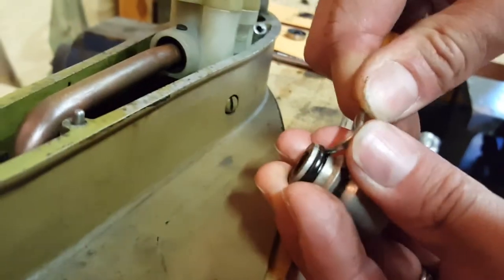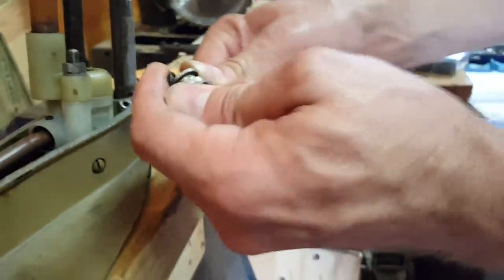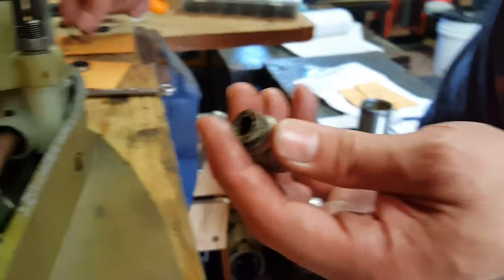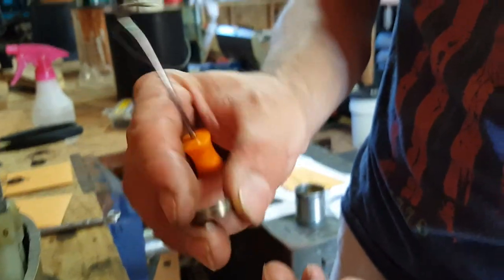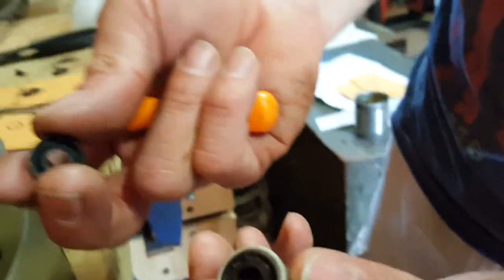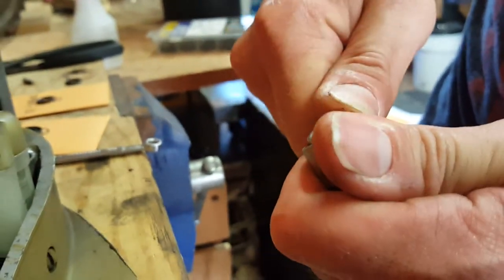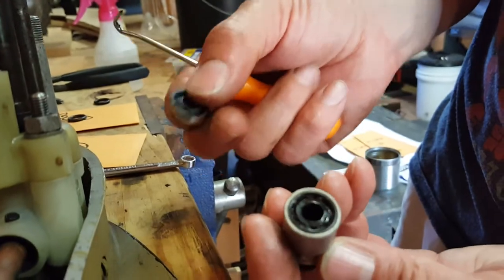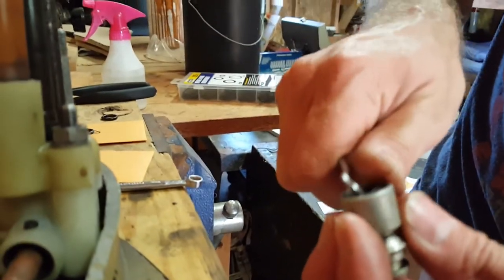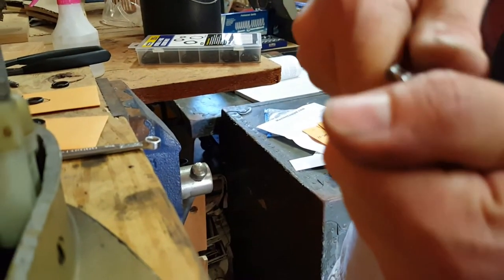Alright, the first thing we do — I've got this little hook tool. I'm going to carefully remove the O-ring without gouging the metal bushing. This is the old O-ring; we'll replace it with a new one. Before we install the new one, you have to pry off the old seal. It's a metal housing with embedded rubber, and I'm also going to use this tool to pry it out. Now you may have to apply heat to loosen some sealant. When we put the new seal in, we will use some marine sealant. This process destroys the old seal — don't even try to keep the old seal intact. It's going to get destroyed and that's okay.